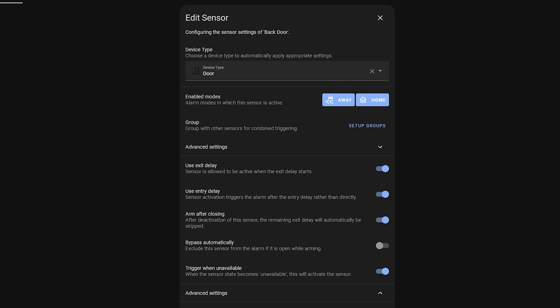Then in the Trigger section, select State as the type, and then in the Entity box, search for your username. In the From box, select Home, which means that this automation will be triggered when I leave home. Then repeat and add another trigger with any other people you may have.